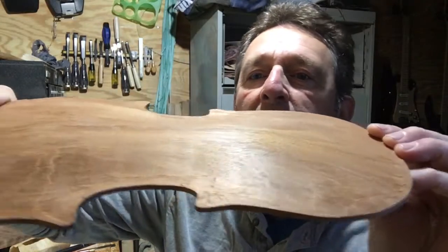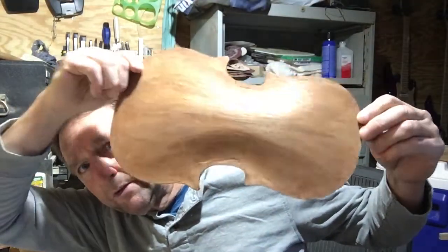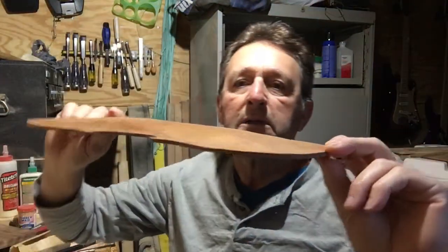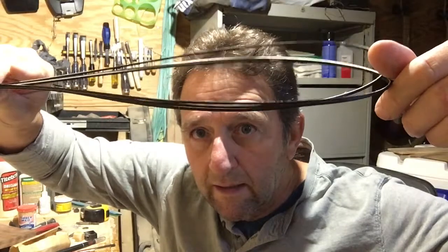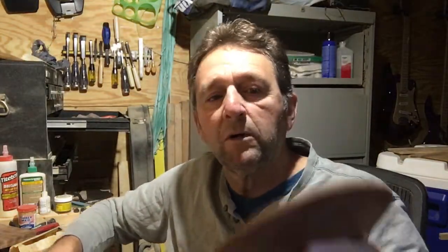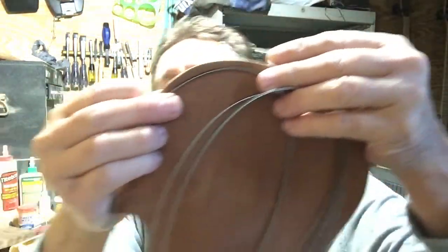Look what I've got — this thing is looking really nice. I've got just a couple more things to do to make sure it's symmetrical, and a little tool to make that's going to help with that. But before I get into that, I don't see any reason why I can't start installing my purfling. It's thin strips of wood. I'm going to cut a groove about four millimeters in from the edge — a tiny groove that a single strand is going to fit in. It's mostly a little decoration, makes it look nice. It's going to really stand out against the dark brown.